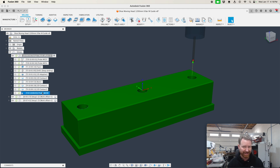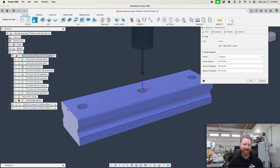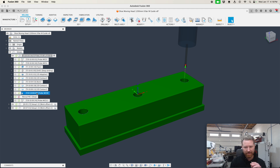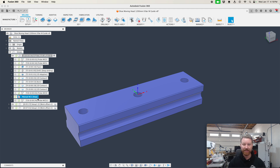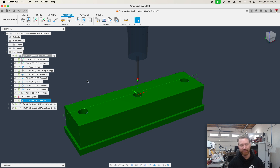We can also put in additional checks. We can go to Setup > Manual NC and put a stop in. Then we say: I need to know this length is also correct. It's going to probe this bore to let us know where it's at and display that measurement on the screen. Then there's a stop so we have time to walk up and see if the bore is correct. You can add as many stops and probing operations as you want, stacking QC checks without having to buy the inspection software.